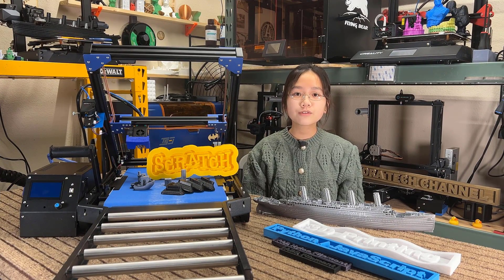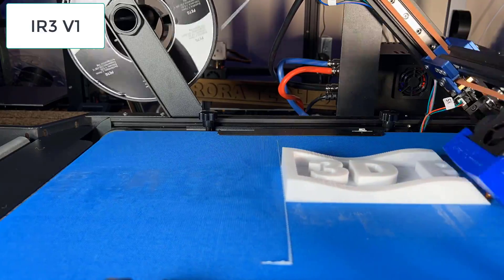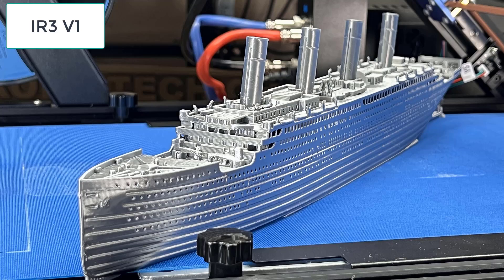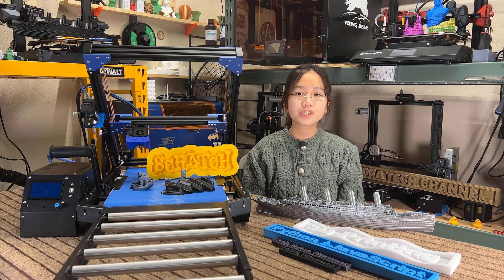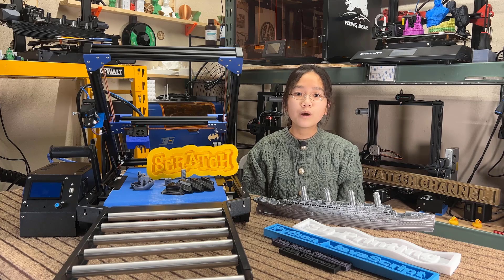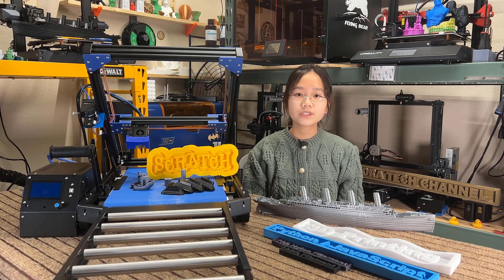In conclusion, this Ideaformer IR3 V1 may not have the best appearance, but probably has the best hardware and the largest print volume for a conveyor belt printer you can get within $1,000. The old IR3 was pretty good, but this new V1 has been upgraded with an all-metal hotend which allows printing materials that require higher temperatures up to 290 degrees Celsius, and this printer also fixed the under-extrusion issue that occasionally occurred in the old IR3. Other small changes like the location of the X-limit switch also made the printing workflow more reasonable. If you're going to buy your first 3D printer, a conveyor belt printer may not be the best option as learning to slice and print correctly is more challenging. But if you need to print something long and want a conveyor belt printer, this IR3 V1 works better than other belt printers in the same price range and also better than DIY conversion kits. The retail price is $699, and if they offer an extra discount on Black Friday, this could be an awesome deal. If you are interested, the link is in the description.